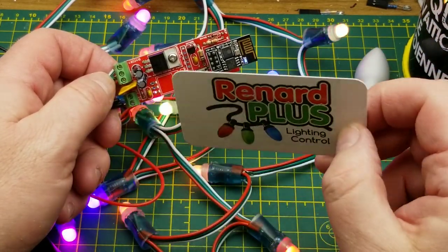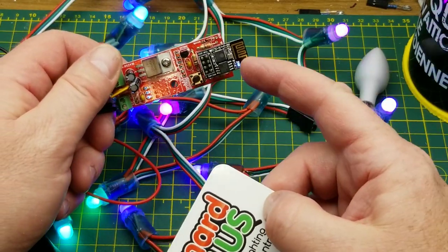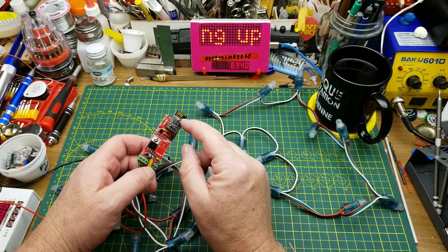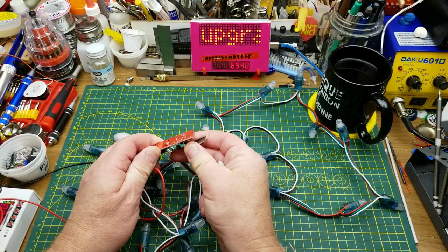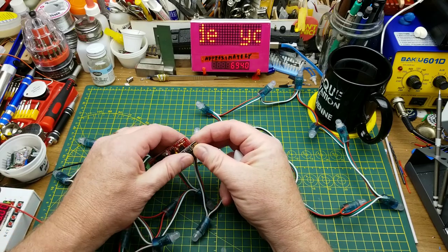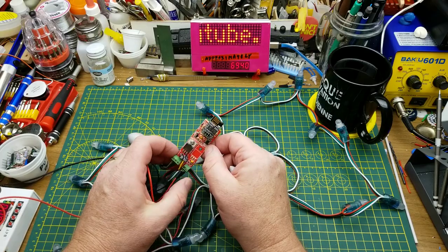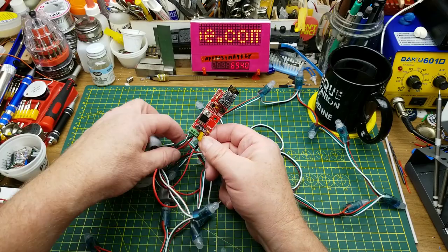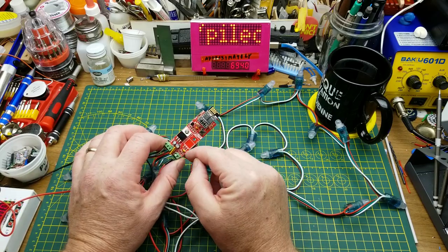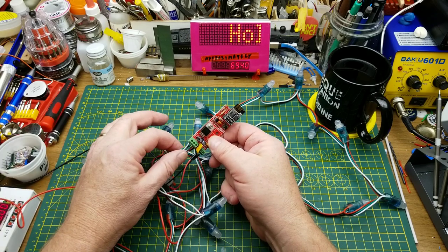So I just wanted to get that straight to make sure that if you're looking for this little board here, you can find it. It's an ESP8266-01. It's a standard one right there. It's running some software called ESP Pixel Stick, and it and this board interface that with the string of lights, provide some voltage regulation and whatnot, making it a whole simple little package.